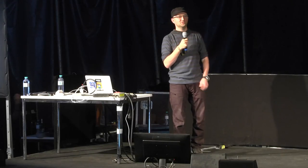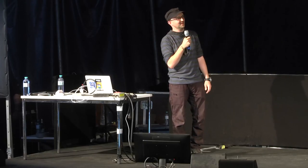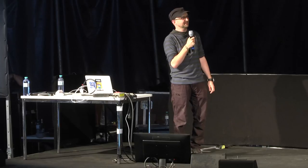So this system's called Chime Red because coils are horrible interference sources. When we were first doing performances with VJs, they went to a lot of trouble to set up these nice projectors and these very long HDMI runs, which are great antennas. I tried to point out that I'm using a 20 kilowatt death ray about 20 feet away, and they said, no, that should be fine. I said, well, let's see. So we play a couple of notes and bam, bam, bam, bam, down. All the controllers go down. You will lose some fuses, and everyone is running and screaming.